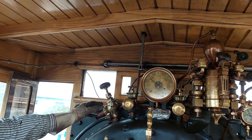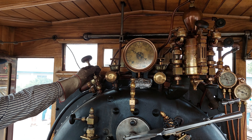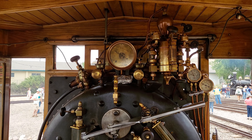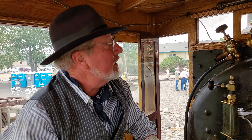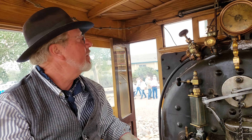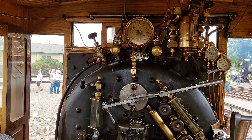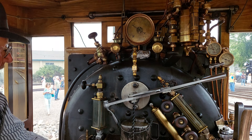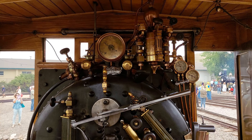I'm going to increase the heat ratio by increasing the blower like this. And that way, it sends more steam through the blower. And that pulls some fire through at a higher rate. Kind of picking up steam a little bit more with more blower, and that creates an artificial draft.